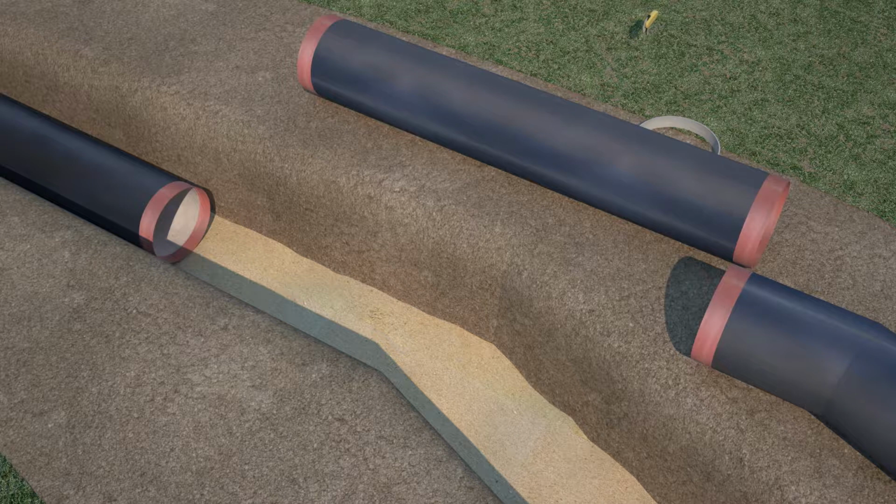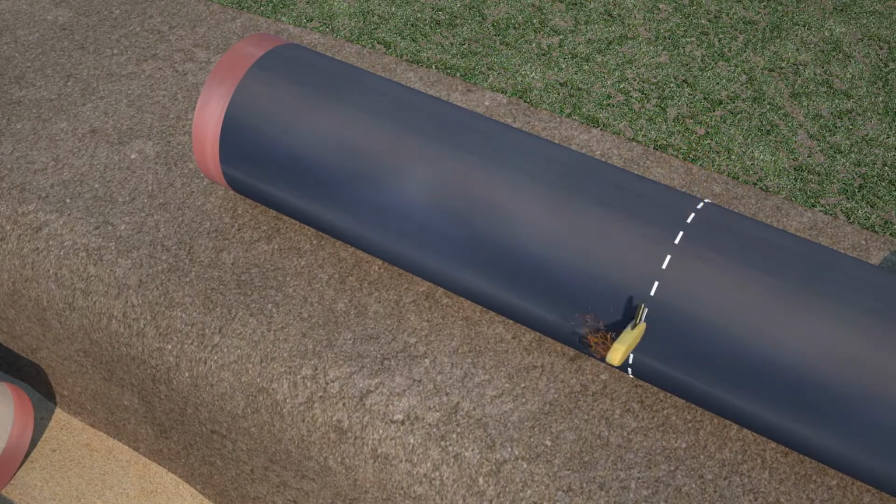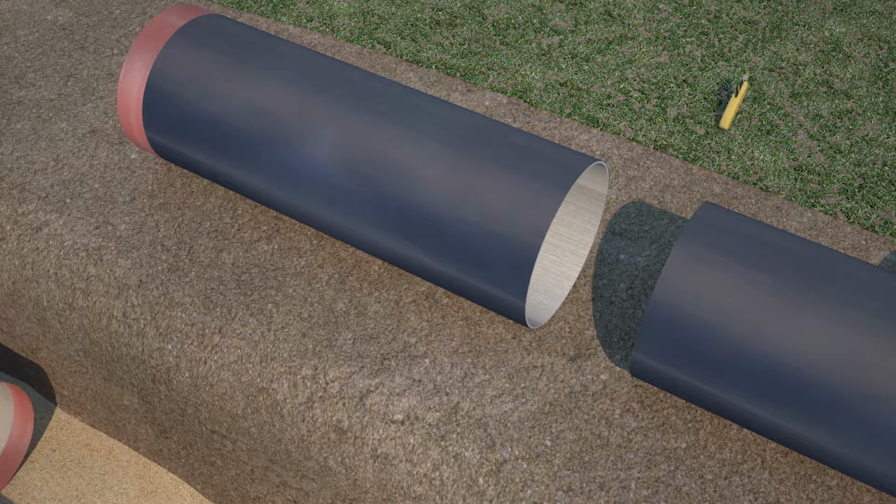A section of this pipe is used prior to the bend to ensure the bend is positioned in the correct chainage along the pipeline. The pup is marked, then cut to the required length. The cut end of the pipe is prepared for welding by stripping the Sintercoat corrosion protection coating and removing the weld crown from the spirally welded pipe shell. The remaining pup can be used on any bend where it is the appropriate length.